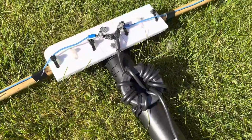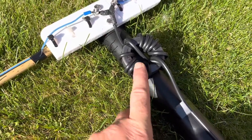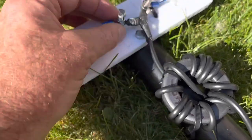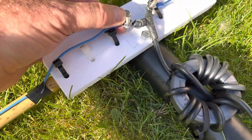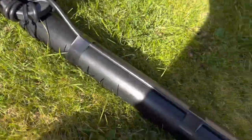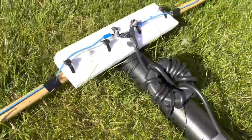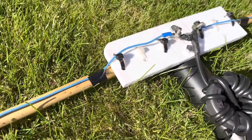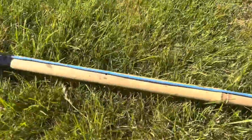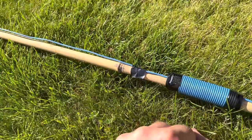Moving the project along to another baking hot day here in the UK — 30 plus degrees. I've cable tied the choke onto the boom, sealed the end of the coax with self-amalgamating tape, used a little bit of liquid rubber, and cut down two small bolts. I've attached a ring on the end of the element on both sides. The coax is taped onto the boom going down to where it's going to be fastened into the center. The two elements run out from the center — four foot, 122 centimeters.